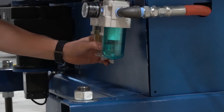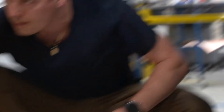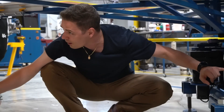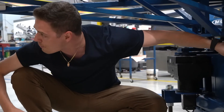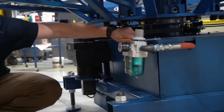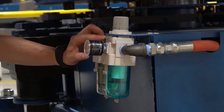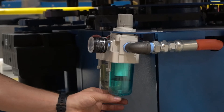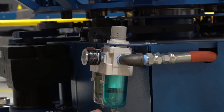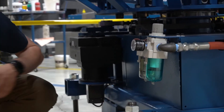The second component is your oiler — the white bottle with 10-weight non-detergent oil. On top of it you have a small oiler adjustment system. If you added oil six months ago and the bottle is still full, it's not lubricating your machine at all — it's not working properly. Simply open and close it: clockwise to close, counterclockwise to open. From my experience, 15 to 17 indexes equals one drop of oil. Check the bottom drain valve every single day — it could be a small latch or a bolt-style valve depending on your regulator.